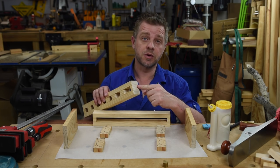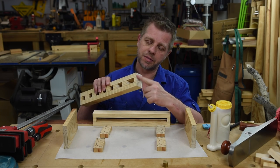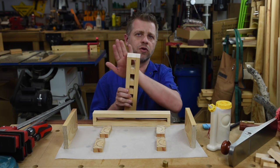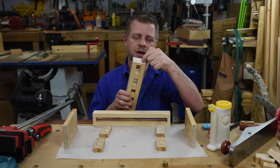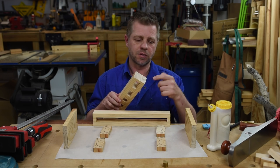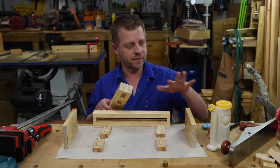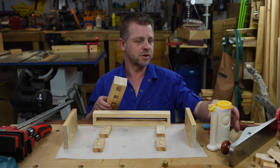We're ready to glue up. Because I'm gluing end grain, I'm going to rub some glue right into there — if you think of end grain like straws, it's going to absorb much more glue than the face grain, so we'll just work a bit in there. I've got a pretty decent surface area for the size of the project so it'll hold with no problems at all.